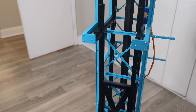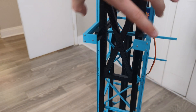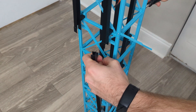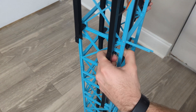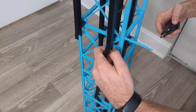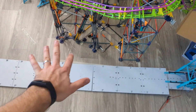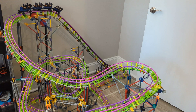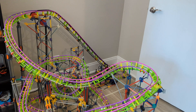The structure is super rigid, and I have zero concerns about how it will handle moving cabins. The floor, however, is another thing. Our apartment was clearly built with the finest Home Depot material, and the floor has high spots and low spots. The tower needs to be leveled to operate properly, so I built in leveling feet that just require spinning the screws to level it to the floor. But it does need to be in a spot where it won't be in the way for the foreseeable future, because if I need to move it, I have to re-level it. There's really only one spot I can put it. So I took down my K'nex coaster — I have a different plan for another one, a record-breaking launch coaster, when I finish up the Demon Drop, so I'm not totally sad to see it go.